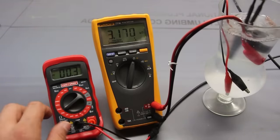You could also use, by the way, the resistance meter to test switches to see whether or not, if you're using a rocker switch, there's good connection. Maybe the switch is bad and there's a high resistance when you press a little bit, and when you press harder on it, there's less resistance.